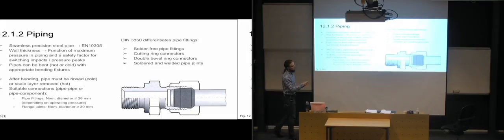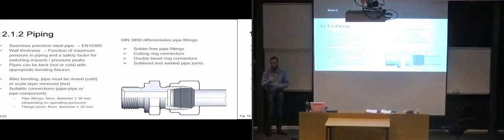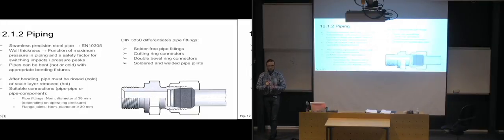So soldering is basically when you're melting a metal and letting it float into cracks. And when you're welding, you're melting a metal along with the material that you're welding together. So then you're fusing it together by melting all of it. But with the soldering, you're only melting the metal that you are actually adding. You're not melting the base material of the pipe. So soldering is used in smaller connections. Soldering is also what they use quite a lot of in electronics when they are connecting wires. So they're using small soldering apparatuses then.